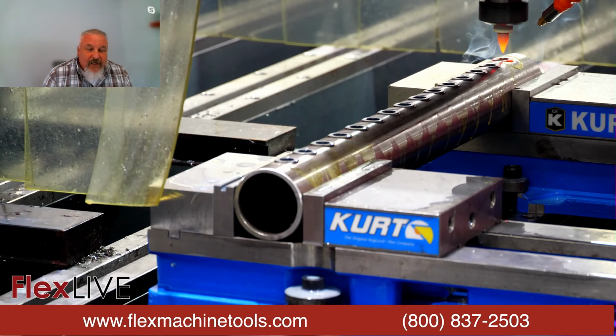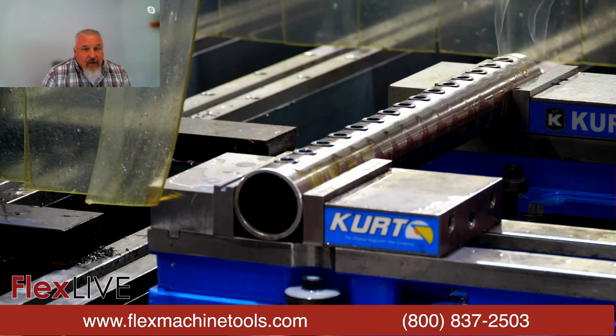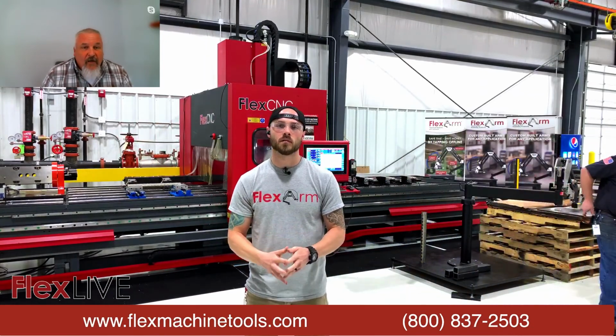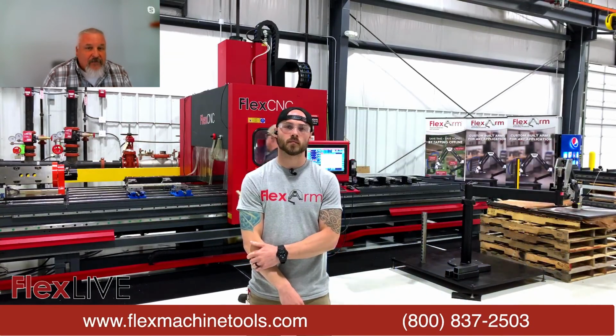What that does, we'll see here shortly, I believe, is we grind 2 cutting edges onto that bit. It comes down and will remove all that upflow material. So if you've got something you're trying to connect surface to surface, that would be the bit of choice. It's going to leave a nice spot face, flush top surface for you.